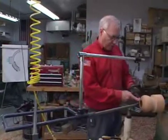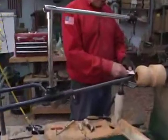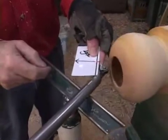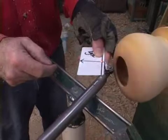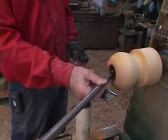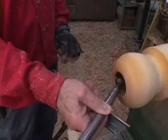So let me just measure a little bit of this wall thickness. I've got the laser set up so that we're going to measure that undercut shoulder. The laser is set with maybe a fat 1/8 of an inch, almost 3/16 thick gap. So I'm going to go in here and make the laser disappear. When the laser disappears, I stop cutting.